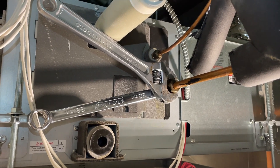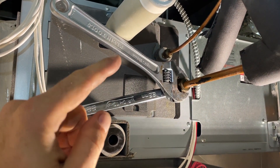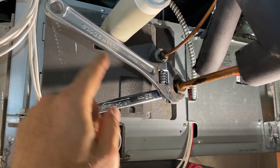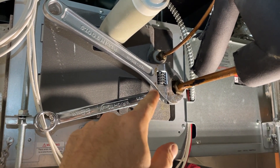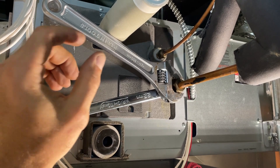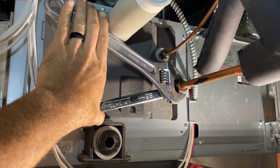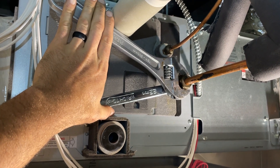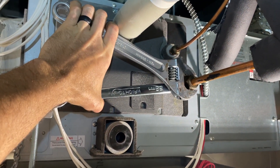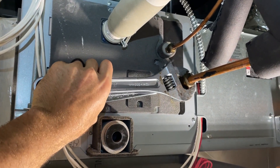The first thing is whether you're using wrenches or pipe wrenches or anything, if you can get them in this configuration, this is by far the best way to loosen and tighten stuff, especially in a tight space. Always try this first — you have less chance of slipping and busting your knuckles and you can actually generate an incredible amount of force this way.